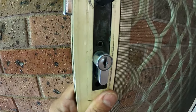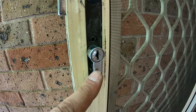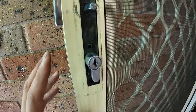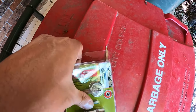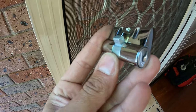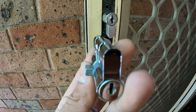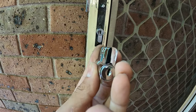Put that screw to the side. Now if we look at the euro cylinder, you can see it's got a lot more play but it's still locked in position. Generally speaking, you need the key in order to unlock it so you can remove the euro cylinder lock. On the new one you can see there's a little cam — that little wing is what's actually holding it into place. When you put the key in and turn it, that rotates the cam out of the way so you can remove the lock.